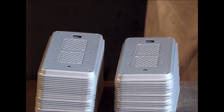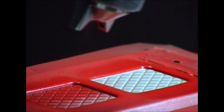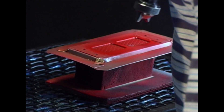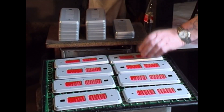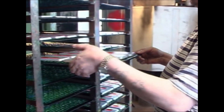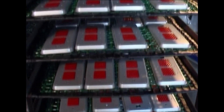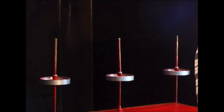In the paint shop, all non-brass coloured and nickel plated components receive their corresponding coat of paint. The brass boilers get a clear lacquer coat so that their shine will last for a long time. Base plates for a driven model are being painted here. Templates offer the easiest method to ensure a clean two-colour coating.